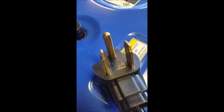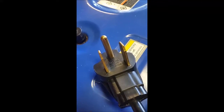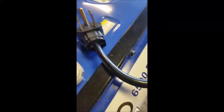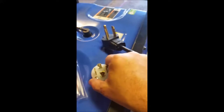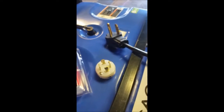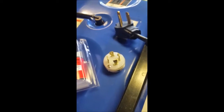This is the plug that is on the generator. Since I'm never going to use my generator inside and I don't really care about the plug, I cut it completely off but I left myself a little bit in case I ever have to put it back together. Now that's a 50 amp connector, and a lot of people are saying this is a 30 amp connector — when you see the wiring inside you'll understand why 30 amps is going to be plenty.